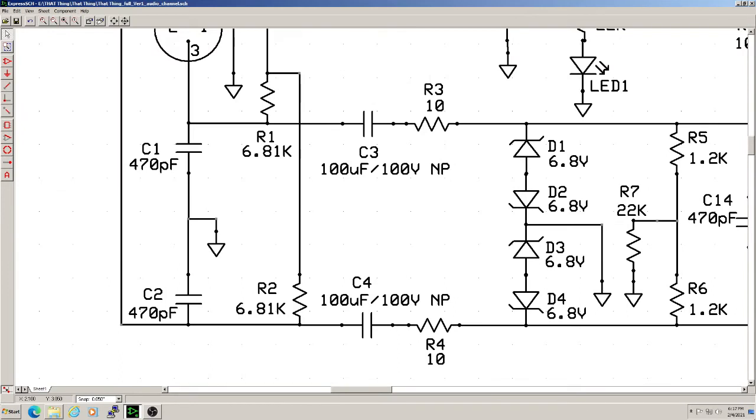Obviously, we want to keep 48 volts DC out of our audio circuit. In some designs, an input transformer would handle this, as transformers pass audio signals, which are AC, and block DC voltages. Likewise with capacitors, which are much cheaper and take up less space. This is why inexpensive designs use them. Here, for C3 and C4, we used 100 microfarad nonpolar caps. 100 microfarads is probably overkill, but the higher value reduces low-frequency phase shift and puts the low-frequency response in the single-digit hertz range. Anything around 22 microfarad or greater will work. Besides, it's very difficult to match capacitors to such tight tolerances.